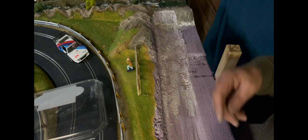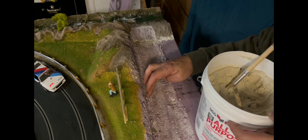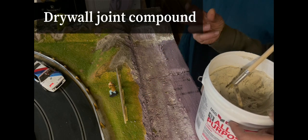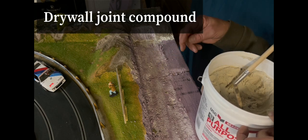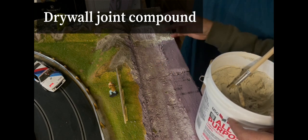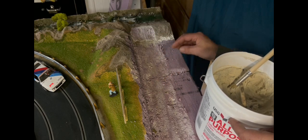And then what we need to do is let this dry, and it's ready to finally put some joint compound on. So now our glue is pretty much dry. It's a little tacky, but we're going to be okay. Being that our joint compound that we're going to put over the top is also water soluble, and our glue is water soluble, it will not impair the glue as far as curing and drying. When we put the joint compound on it, it'll breathe enough that it will allow everything to dry simultaneously, as long as it's not too wet. And it's not; it's tacky, but it's not wet.